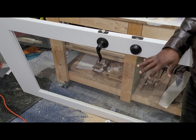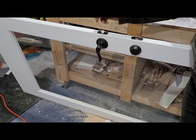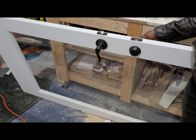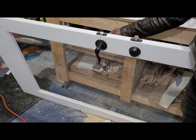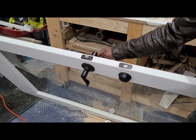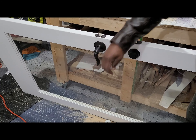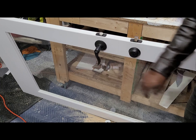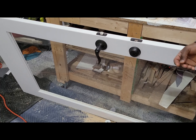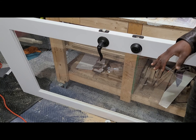So basically, if I lock here, you can open from here. If I lock here, you can open from inside. But if I lock both, you will need at least one key to open on either side. For example, if this one is locked and this is locked, and I'm inside, I'll be able to open one side but I'll still be locked in. And if both are locked again and I'm here, I can unlock one side but will need a key on the other side. That's the goal for the security on this basement door - to control access from one side.